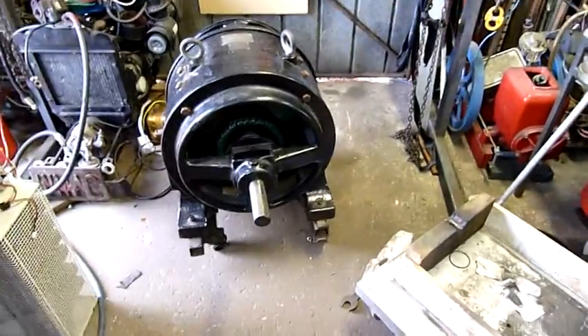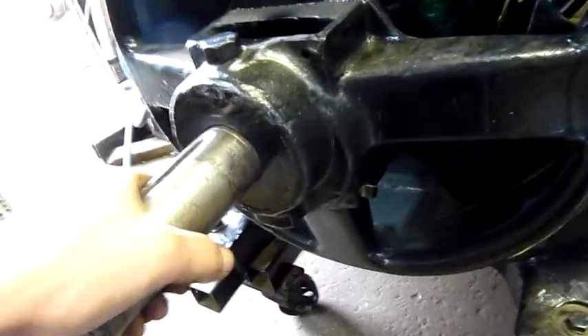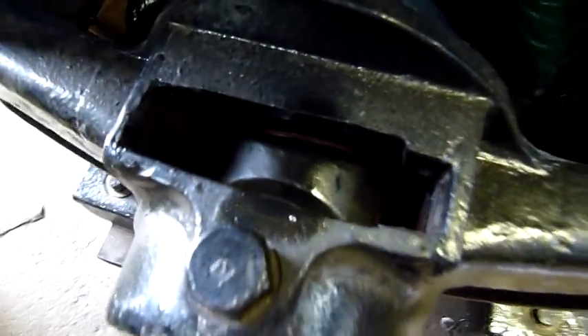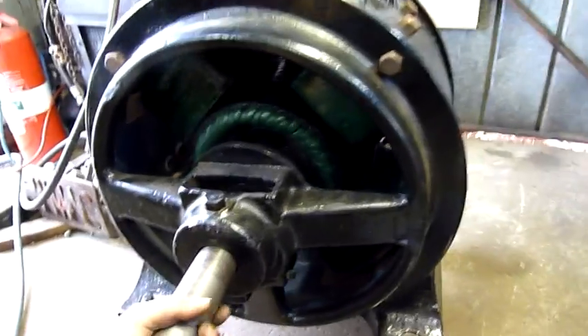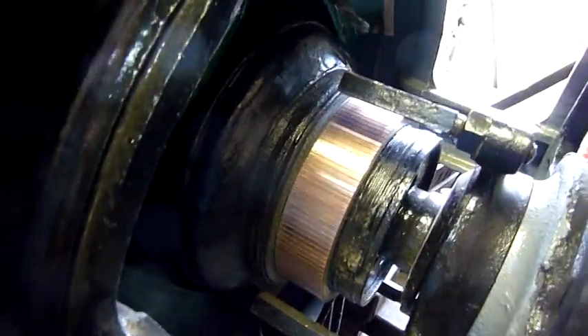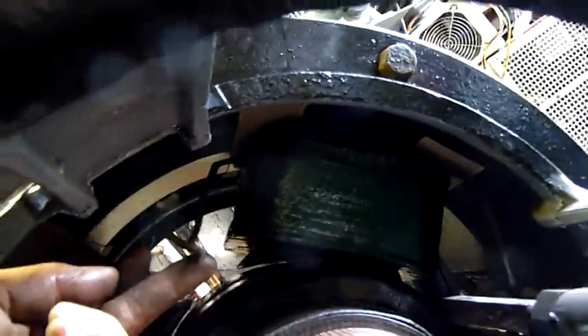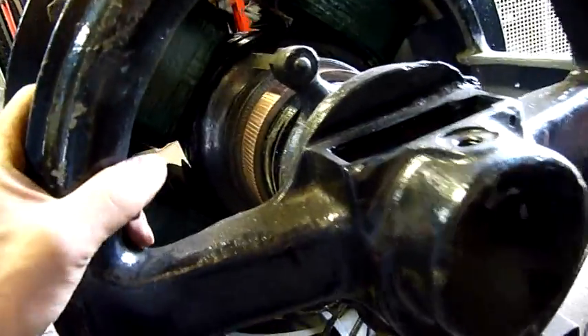Well, this is what people wanted to see quite some time ago — I've actually got it back together again. Still a lot of fit and finish to do: clean up bolts and things. I'm going to give the whole thing another overspray because the outer housing is a bit nasty and there's a lot of dirt on it. I just sprayed a bit of Inox down inside the bearing housing so the rotor bearings are happy. It spins pretty free though it's a nice heavy rotor — must weigh about 150 pounds, 75 kilos. I'll probably have to take the end bell off again to set the brushes. There's still a lot of wiring to do — that's the hard part, working out how to rewire this thing.